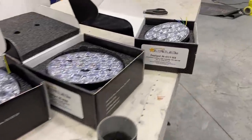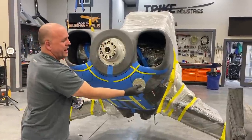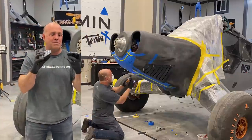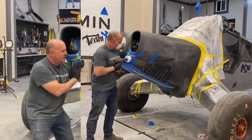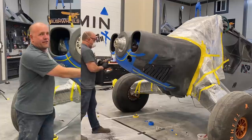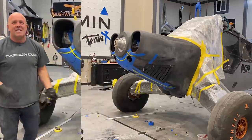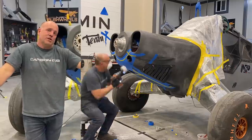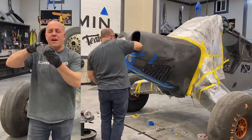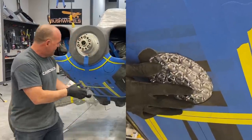So I'm doing two sets of lights and a calculator draw out. I've got two lights that will go here and here. I've got them positioned on the radius so that when I get them installed, they're pointing left and slightly down, and right and slightly down. I've got the angle deflection from the website. They're tipped so the two blend in the middle, just overlapping a bit — really good peripheral view, great for taxiing or coming in two-point. For coming in three-point, I've got another light down here. It's going to light up kind of right outside your side windows, almost straight down and forward. But if you get into a flare, it'll rotate up and shine at the runway, so the runway stays bright — transitional lighting.